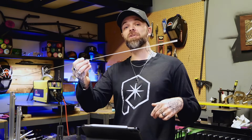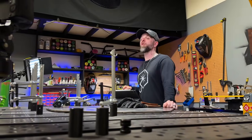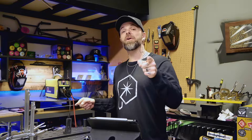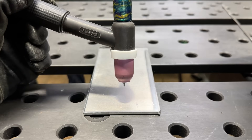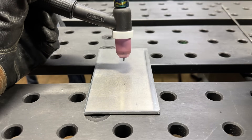The first trick is going to be done with the filler rod. This is one of the most common things that people struggle with — not knowing how to feed filler material properly. You're going to take your torch hand and do a couple dry runs back and forth. Get comfortable and have a good range of movement. I'm also going to give you a couple tricks with that in a few minutes.